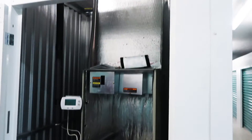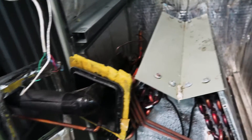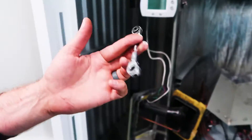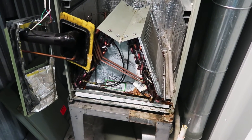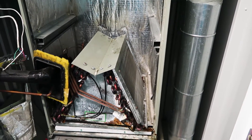This is actually a pretty easy application. I don't even have to unsweat this coil — it's so small. You just lifted it out of the drain pan? There are two screws on the back. If you don't have some sort of tool — I showed this tool before — getting those two out of the back is going to be fun. So you just took the two out of the front, slid it in, took the two out of the back and just lifted her out.